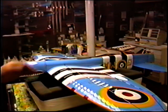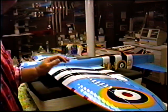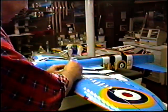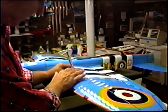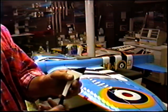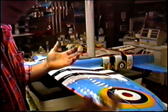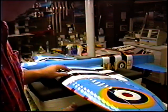And also, one of the considerations is the landing gear on this wing is further back than it is on the D-tube wing, so I'm trying to take into account, and I was just trying to interpolate, given the fact we have all these extra sets of landing gear, even though this is not going to be a real good way to do it, just to get some idea. Now I can almost guess that these are going to be too long, so I can bend up a set of wires pretty much with the idea in mind that this leg needs to be a little longer than normal. So I'll make one up maybe a quarter of an inch longer than normal, make up a set of wires, and again, you need to do this in this case by eye almost, and with a vise, without my pro bender.